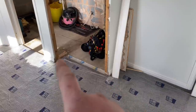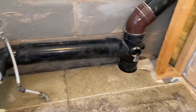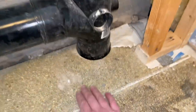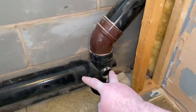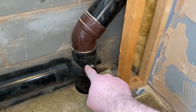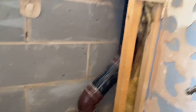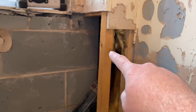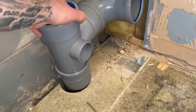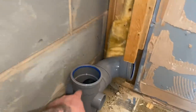We'll keep the bits of skirting we took off to re-fit them around here when we finish. This soil stack has got to be cut out low level — might have to get a bit of floor up. We'll cut it low level, glue a different branch on that'll swing this way for the toilet, which is coming here, then elbow off and up to the vent. So we'll cut that out, get rid of that, take that boxing off, cut the pipe and get a slip coupler on it so we can get the new inlet, cross for the toilet, and off the top into the vent.